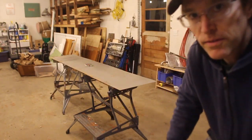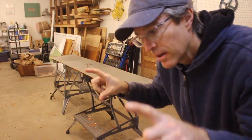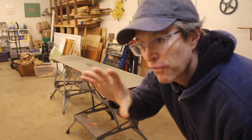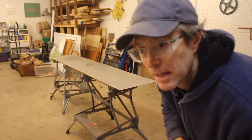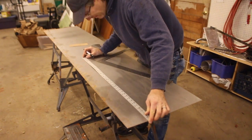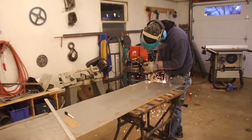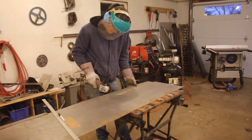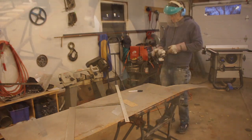Right now what I'm doing is creating a shroud — like a surround around this fireplace insert. I'm going to cut up four strips, kind of like making a picture frame, weld them together, flatten it out, and paint it matte black. For oxy-acetylene welding, goggles must be used with lenses of special colored optical glass which protect the eyes from the bright flame and the intense glare of the molten metal.